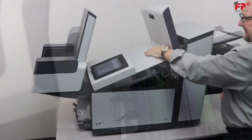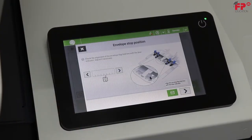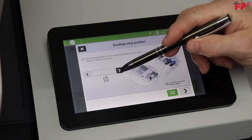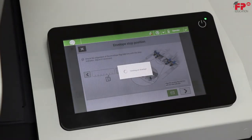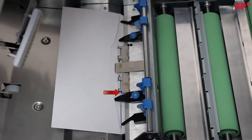To adjust, close the upper unit and use the scale on the screen. Touch the arrows to move the envelope in the direction you desire. Since the crease of the fold is to the left of the paint mark, touch the right arrow. I will choose 4 increments and re-check the stop point. Now the crease is right at the edge of the paint mark. The output will need to be used to fine-tune this part of the adjustment.